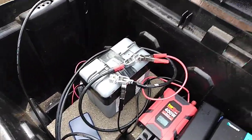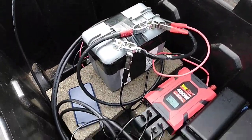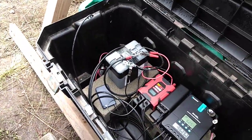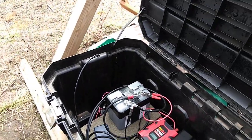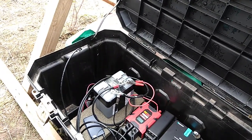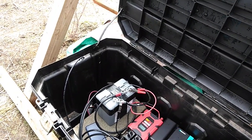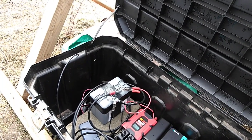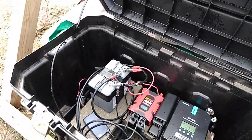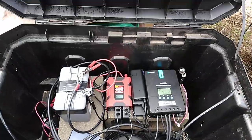We need more batteries, but this is an awesome battery — 25 bucks. It was a gamble; about 500 bucks to buy new. It wasn't working properly, so my wife suggested we cut the case off and see what's going on in there. I took a hacksaw and cut the top of the battery case off. It's full of batteries, but it had a circuit board on top that was corroded with some cracked IC chips. Took that out and wired the batteries inside directly to the terminals. Clipped everything back together, nutted it up, and taped it back together. Works great — I get about 40 hours of running my laptop and charging phones. Now it's part of the system here.